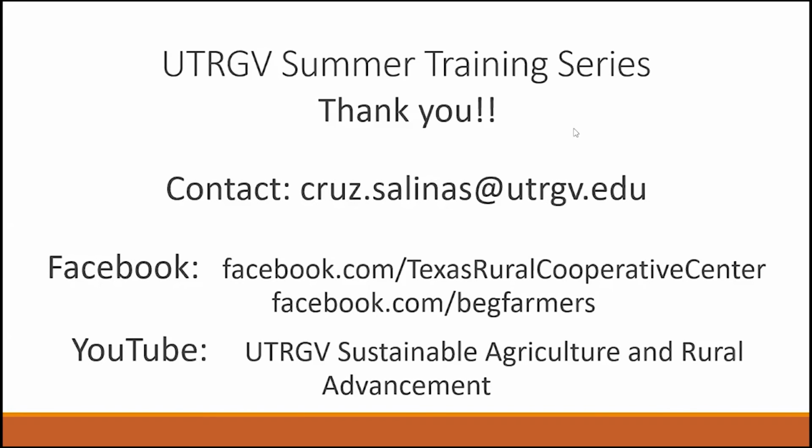But the one that I used was sort of like in between. Actually, I was spending 15 to 20 minutes in between times, and the consistency of the concrete mix made no difference whatsoever. So once again, if you've never worked with concrete, it may be a problem, but if you work with it, sometimes you're able to add just a little bit more water, so the consistency, you're able to work with it. That's why I tend to pour a little bit more water than I have to. That way it doesn't get hard on me, and then just leave it longer for it to cure.